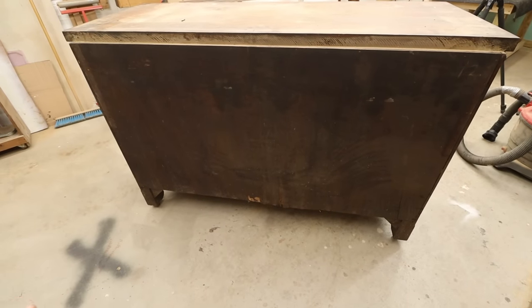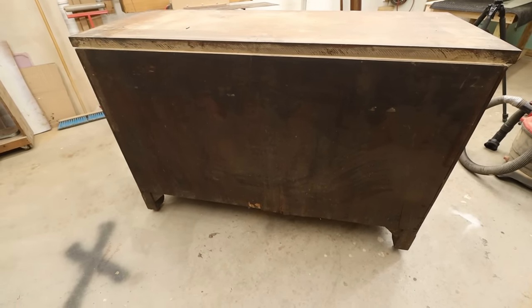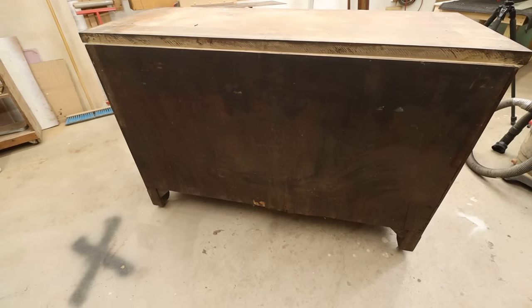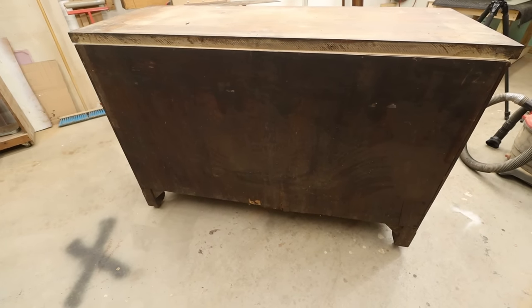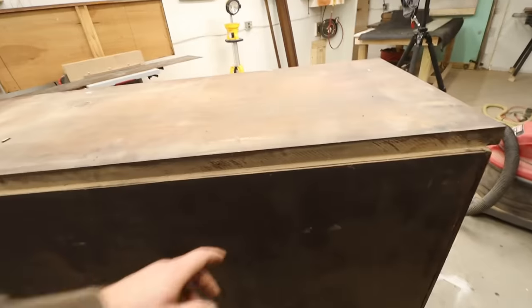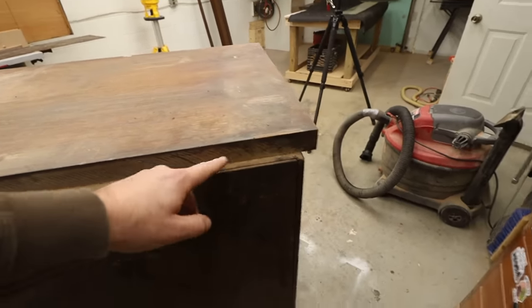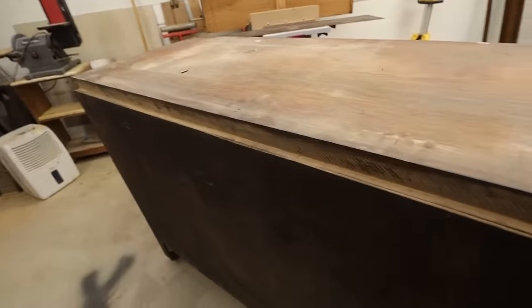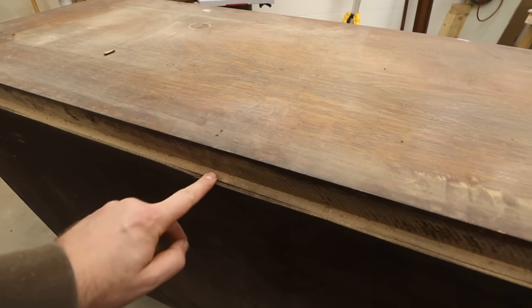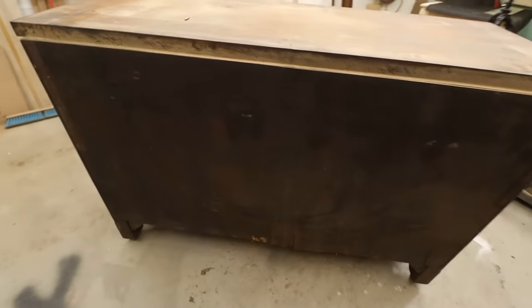So what I think I'm gonna do is just flip it on its face, load any part of it up with glue, and then weigh it down and let it sit overnight. It should be glued nice and flat. It's not supposed to be glued on really tight, but if there's anywhere that's really loose, maybe I'll add an extra nail in there to get it a little bit more secure.